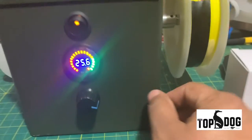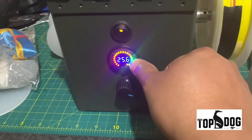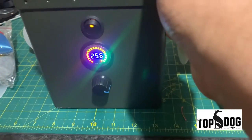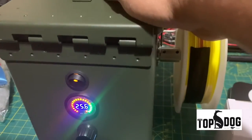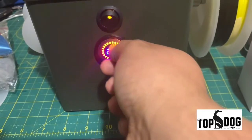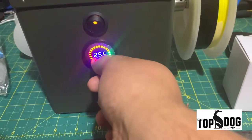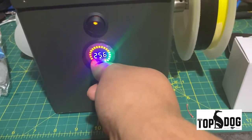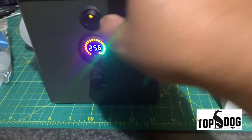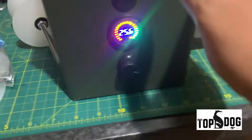This colourful light — you can see green, orange, and red. They indicate the ampere, the current that goes up and down based on the usage of the machine. It's a heavy 360 watt motor being used in this one. So I will not consider this as the battery percentage — it might still stay green while the voltage drops to 24. Don't pay attention to the light because it is based on current completely. For the batteries, you want to focus on the voltage.